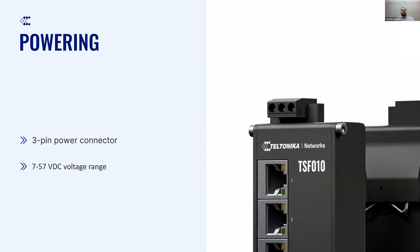This Ethernet switch features five 100-megabit Ethernet ports, which are sufficient in industrial applications. TSF010 follows the RUT140 or RUT142 in terms of powering and features a 3-pin power connector. One more feature that makes the device suitable for a wider field of applications: its powering voltage range is from 7 to 57 volts. Martinez, could you introduce us a bit deeper about where this device could be applicable?